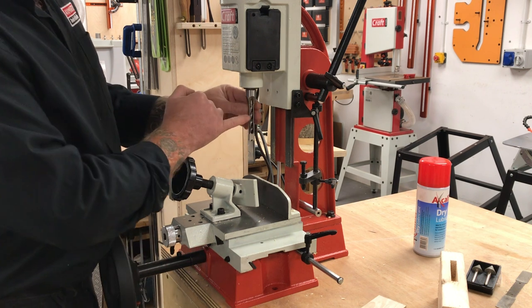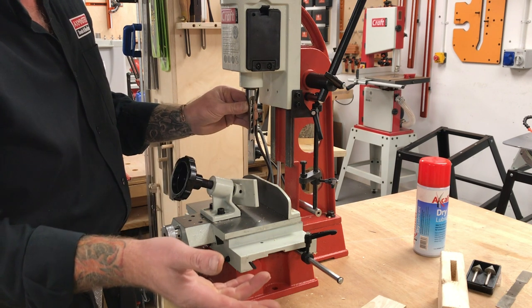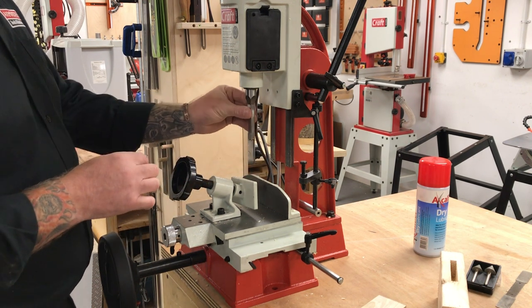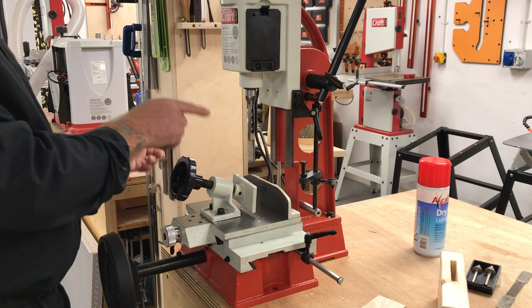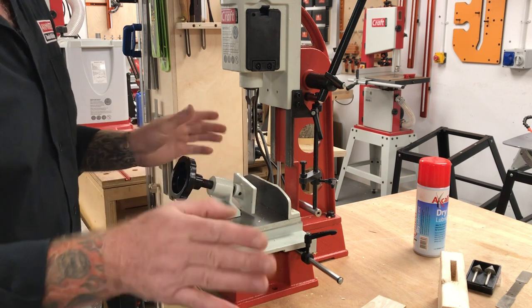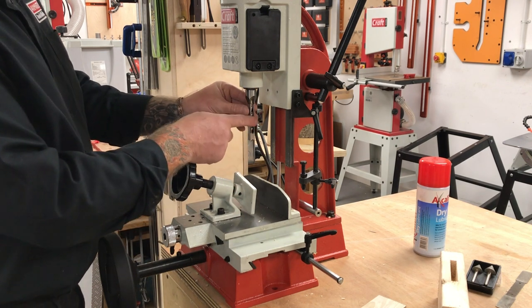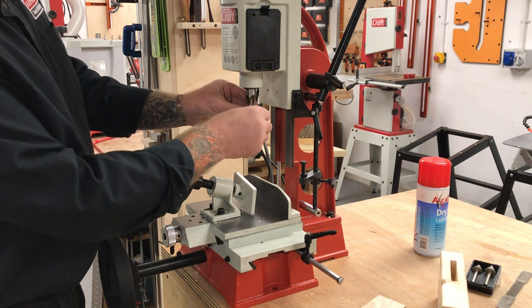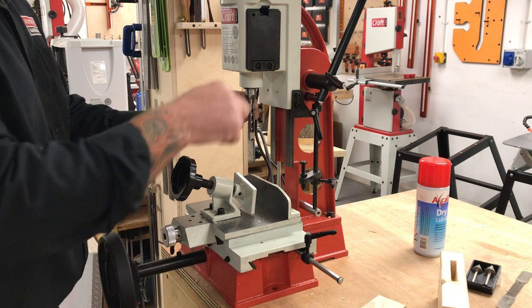You might notice there's a long slot cut in the side of your chisel — that's for waste clearance. I like it on the side, not on the front or the back. I like it on the right if I'm traveling my workpiece toward the right, or on the left if traveling left. The importance is that the slot is on the side so it allows the waste drawn up by the bit to be ejected out of the window into the hole you're creating. I'll explain that further when we actually do some cutting.